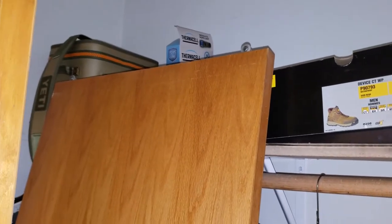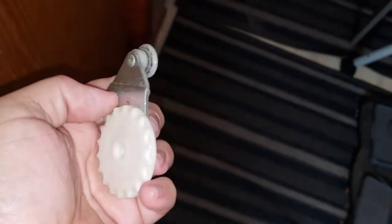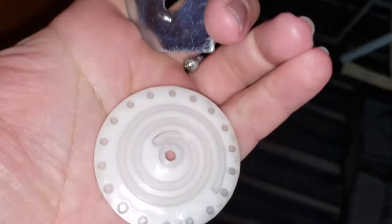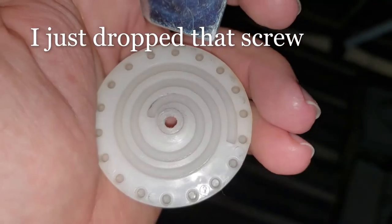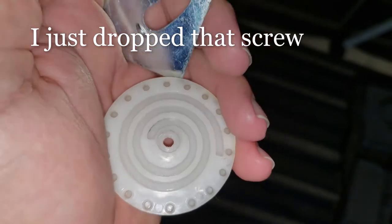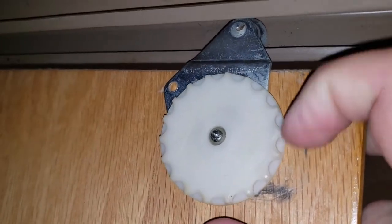Both sides have fallen off and this one completely fell the other day, so now's a good time to fix it. I'll take this screw out. The mechanism is fairly simple — you've got the part that attaches to the door, the wheel that rides in the rail, and then this part here. This little finger in the metal slides within a slot and that allows you to raise and lower the door so you get the perfect amount of float, sits level, and glides nice and smooth.